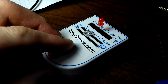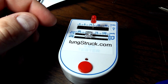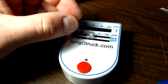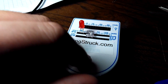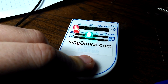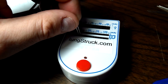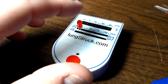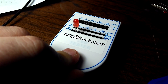The one thing that is an issue, though, is over here — it's marked that it can check bi-color LEDs, either a common cathode or common anode. The common cathode side works fine. If I just test it with a single color LED, you can see that lights up, and reverse it over here, it lights up. Same with this side of the common anode test, no problem. However, for whatever reason, there is no resistor on this side here. It's just the way they designed it, and the way the circuit board is designed, so there's really no way to fix it. So it's gonna get the full 9 volts — and there's the magic smoke.